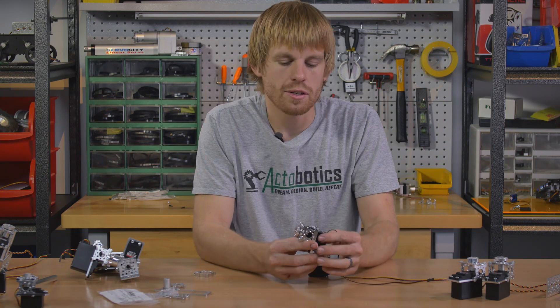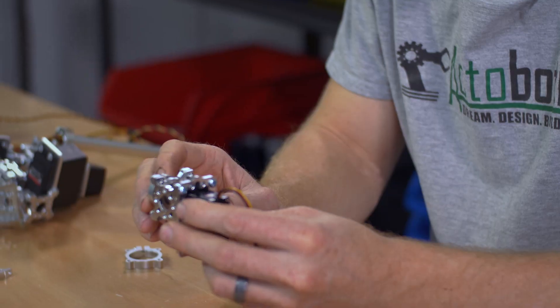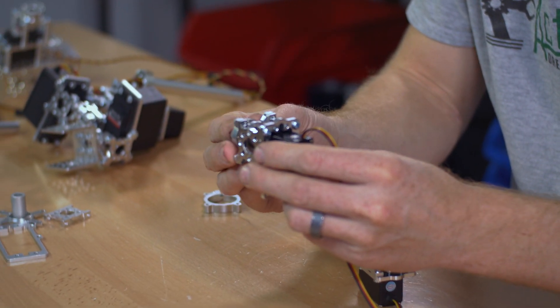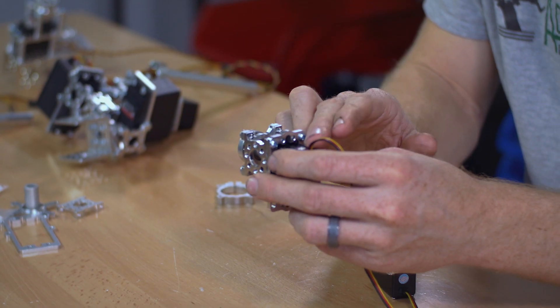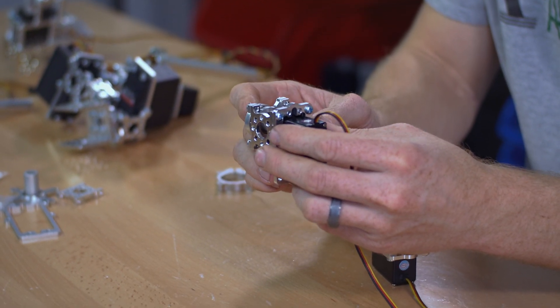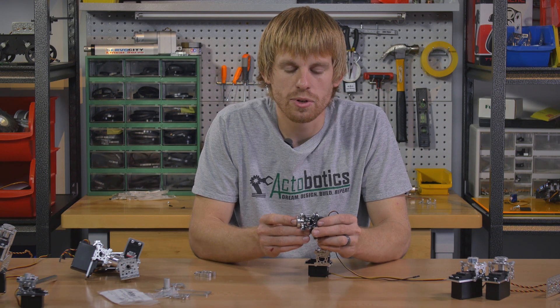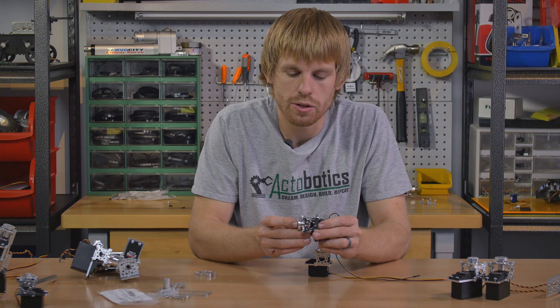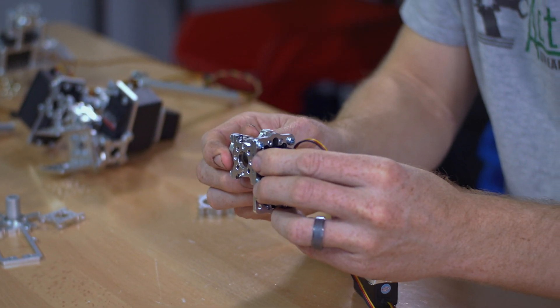So why would you want to use a servo block? The biggest thing is the fact that it takes out any of the radial load that gets transferred into the servo. You've got a large 1.5 inch bearing out here that's supporting the shaft, so you can put a large load on this shaft without worrying about adding friction inside of the servo or having little tiny bearings or bushings taking that type of load. A servo has a tiny little output spline and it's really not intended to take a radial load. With the servo block you can load it up and it's going to be able to rotate it no problem.